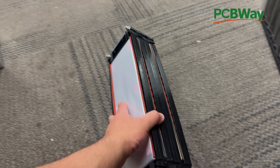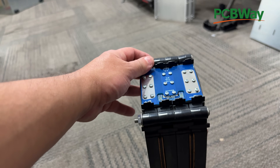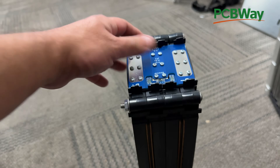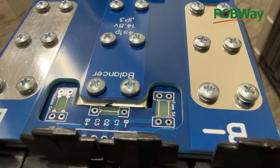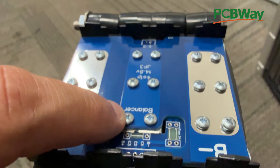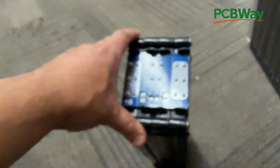They're LGs and they can do a lot of power. They are pouch cells and they come in these big modules that are not welded together. Because they're not welded together, it gives us the opportunity to rearrange and build battery packs that suit our needs. Want a 4S like this one right here? I made these little PCB bus bars so that you can easily just screw them together — screws sandwich the bus bars, squeezing the cell tabs between the bottom board and the top board, applying mechanical pressure to transmit power from one cell to the next.